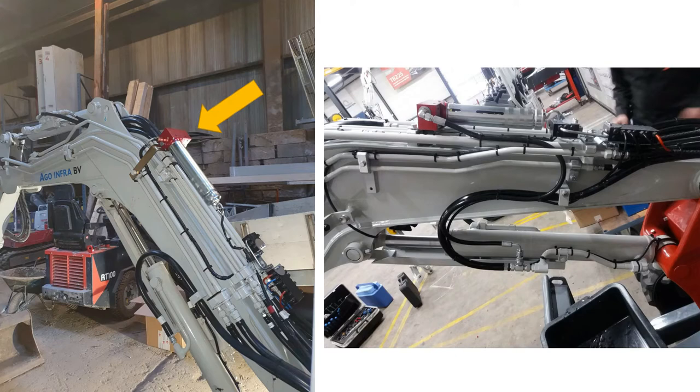Also notice that in both pictures the orientation of the pump seems to be upside down. However, the grease in the pump is pressurized with a spring, giving positive inlet pressure for the pumping element, so the orientation of the pump doesn't matter. It will operate and can be installed in any orientation.